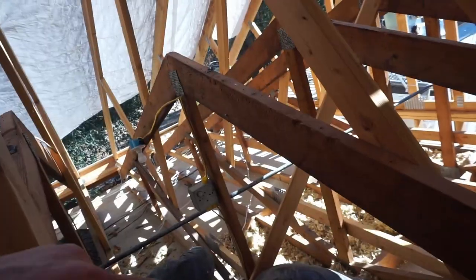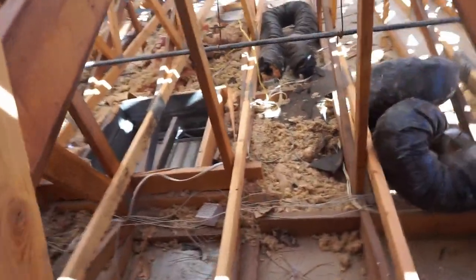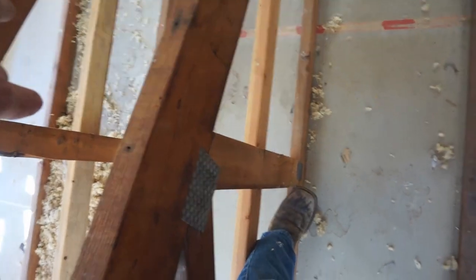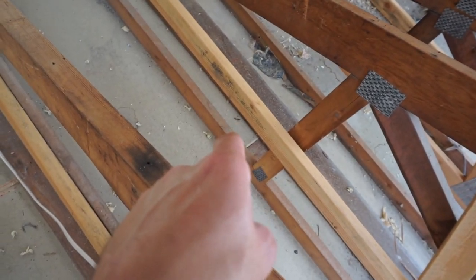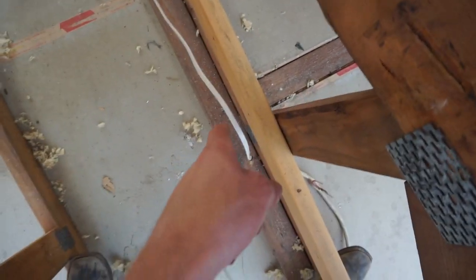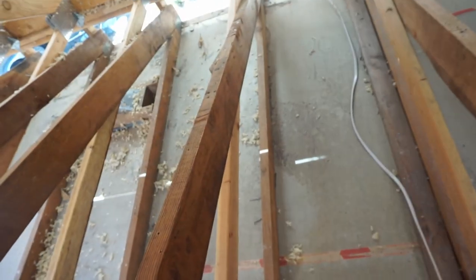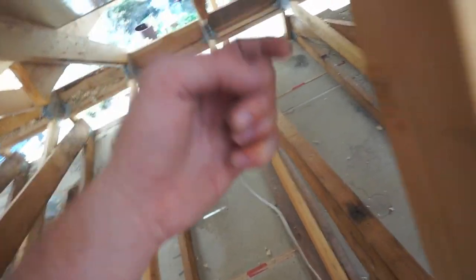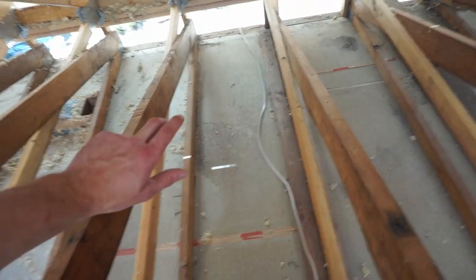We're up in the trusses — old roof trusses, new roof trusses. We're going to run our wire where it needs to go, trace what we need, and do some splicing at the junction boxes properly. Over here they have some pretty improper splices — we'll show you that in a bit. For example, we've got this wire going down between this bedroom and that bedroom, it powers wall outlets. We're going to splice this into a wall outlet so that multiple things are on one breaker. It seems like there's two breakers per room right now, so we're going to consolidate a lot of that.